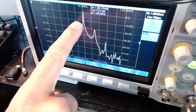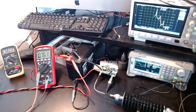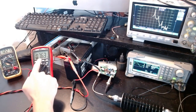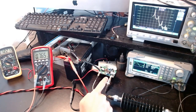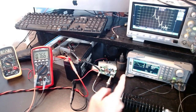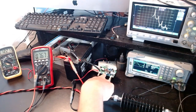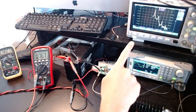We're now above 0 dBm as expected — the amplifier is amplifying as it should. The current has risen significantly to 0.7 amperes. The amplifier is outputting around 32 dBm, which is more than 1 watt. Let me try to reach 14 dBm from the signal generator, because 14 plus 26 equals 40 dBm which is 10 watts, and after minus 30 dB attenuation I expect to see plus 10 dBm.